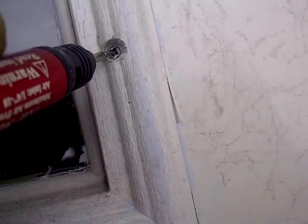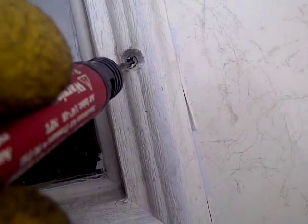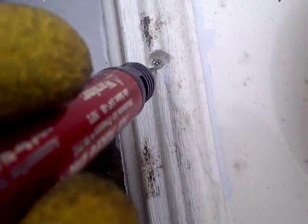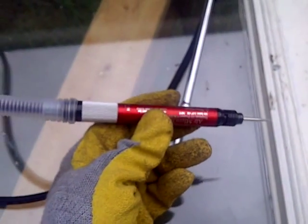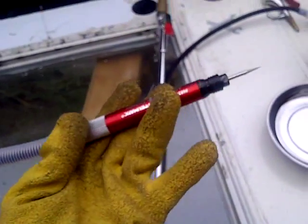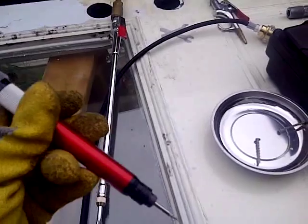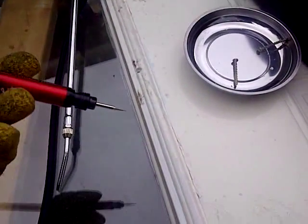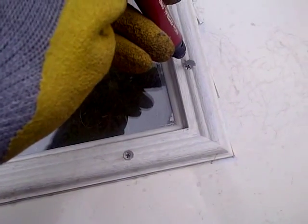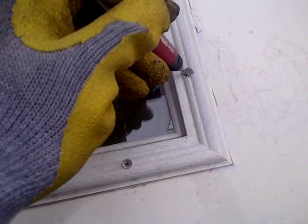Before I get that done, I've been using the micro grinder. After I grind it out, I'm just trying to open this spot a little bit more so my bit can have a little bite to it. So I'm going around doing that, just trying to clean it up. The micro grinder comes in really handy — sounds like a dentist drill. This is my first field test on this and so far it works really good. It will grind the metal; these are diamond tipped. So it will grind the metal but that's alright.